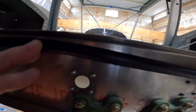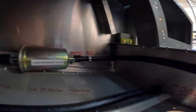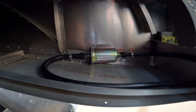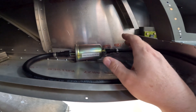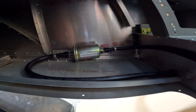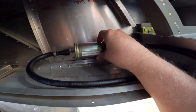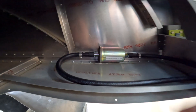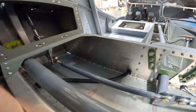The fuel line feeding the engine will be clamped up to this rear bulkhead here. It'll cross over the top of the rudder and elevator cables, come over here, and make a nice loop — call this the service loop. This is where the high-pressure fuel filter is. These are Honda quick releases, so you can easily take them off, swap out the filter, and put a new one in very quickly — all accessible through the port on the bottom.